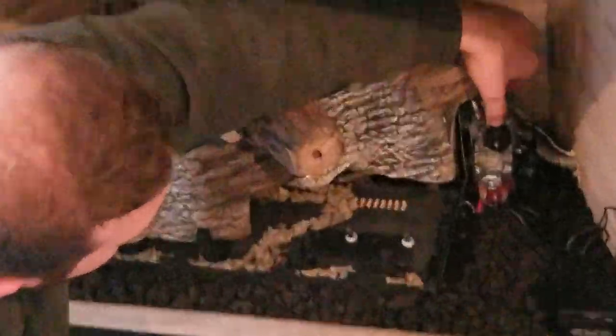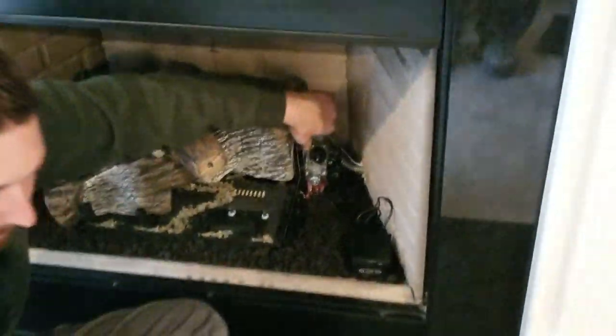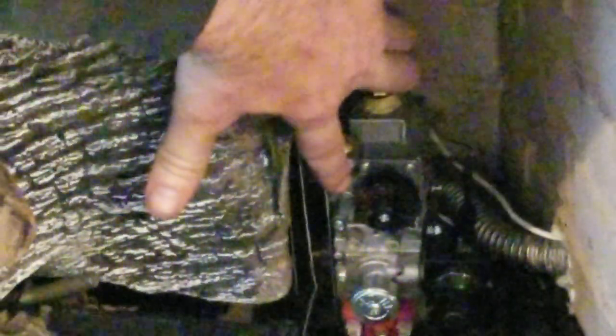This is your pilot control knob or your gas control knob. This should be the only time you get down here — at the beginning of the season to light your pilot. On this knob, it is hard to see, but on the left we have off. Right here towards 11 o'clock we have pilot. Pilot has a raised L — that is the pilot position. And then over here we have on. All the way at your nine o'clock is the position you're currently in, marked by a little teardrop piece of metal. From here we're going to go counterclockwise to the raised L, and it should slide into place on the raised L.